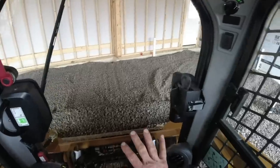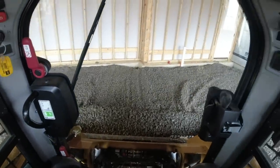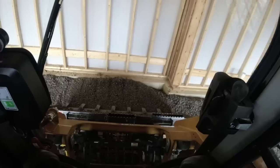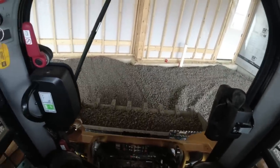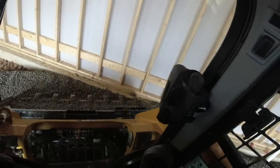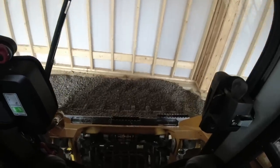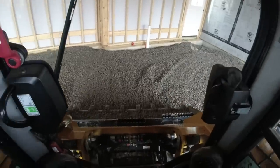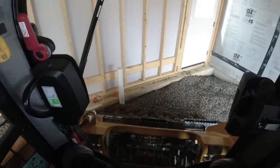As you notice I'm coming in — you can look right through here and see that track. The way they angled this grading, they purposely did that for visibility out of these corners. You can see that track in relation to the wall and in relation to the floor drain. So I just fluff the stone up to the wall height, give it a little shake back, and then I just take my teeth and pat it down. I'll still tamp that, but it's not going to go down much. You can come in sideways and sort of sweep it over into the corner.